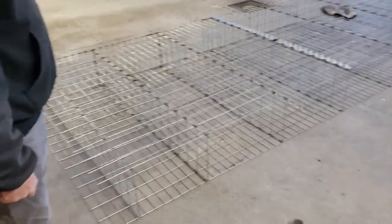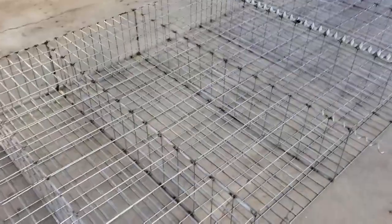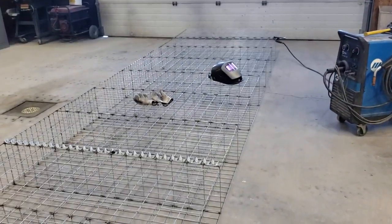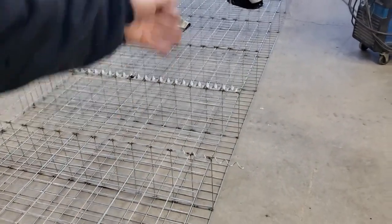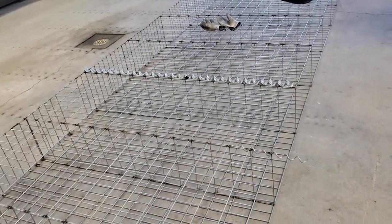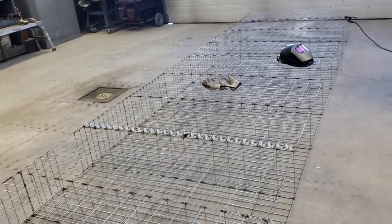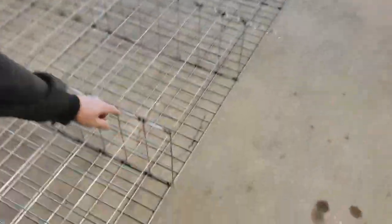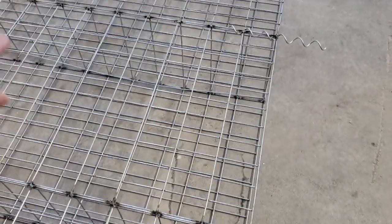Moving into the larger area of the shop, we're going to tell you about what we did to construct these. Because of the cold weather, we're building these Gabion cages — baskets — in 20-foot sections, as you can see, and they're five feet in height. We're also putting bottoms in them because that's what your rock rests on. We've elected to build these in the shop. Spot welding here — everywhere there's a seam, you can see the dividers inside. These are approximately two feet wide and then a foot inside, so we've spot welded to help support this.